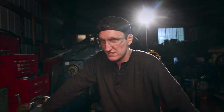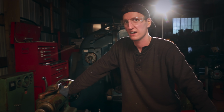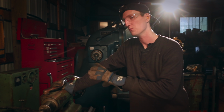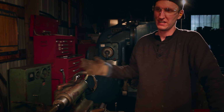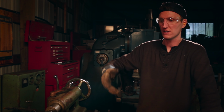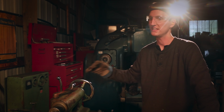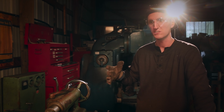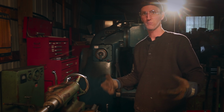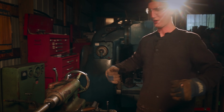Awesome. So with this 3/16 plate, I'm struggling a little bit to get the heat I need. The previous bowls I did were out of 10 gauge, and with these two torches, you could actually get up to a nice yellow heat or a little bit above that, and you could really tell because you're pushing on the material, you can really feel the plasticity of the material. When it gets to that elevated temperature, it becomes so soft and smooth to work. Whereas with this, you're struggling a little bit, and it takes about all I can throw at it at some points just to get it to shape. So it's a good upper body workout.